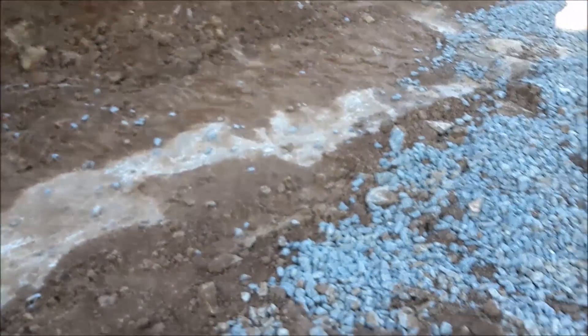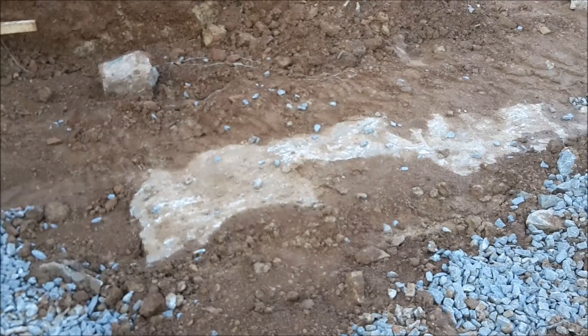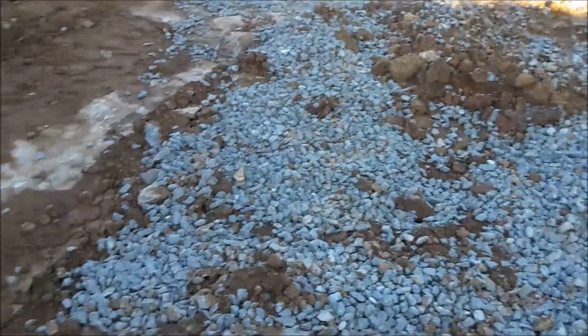You see the little hole we're in here, and that footing's got to be 10 inches deep, but we're not going to get that depth, so we've got to form it up. You can do that two different ways — you can use ground, rock, whatever. We're going to use two by 10s.